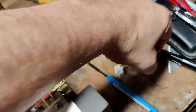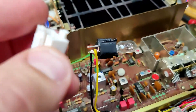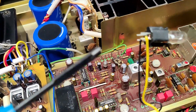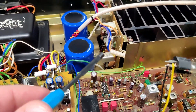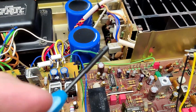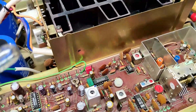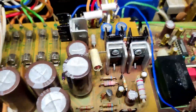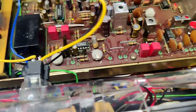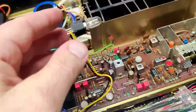What I'm going to do is install the new updated version in white ABS, high temp. I picked up a wire wrap tool — I've been meaning to grab one for a while, but they're like a hundred bucks. I got this off the big-A store for 19 bucks; I'll post a link below. It fits the pin quite nicely. It's a 22-24 AWG, and I was under the impression that we needed a 20, but this actually fits all of the posts on this Pioneer unit. Save yourself some money and pick up the $19 version.